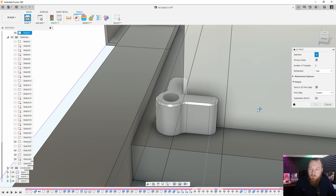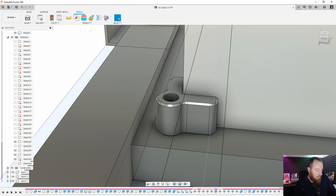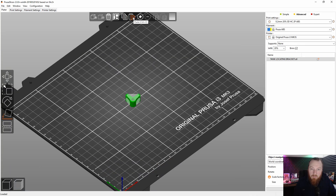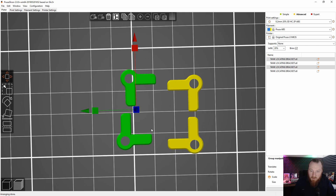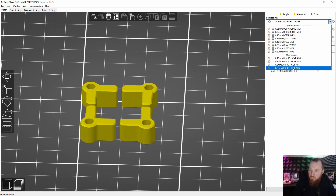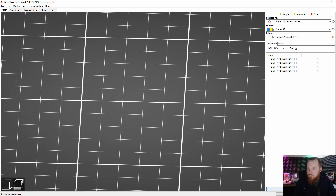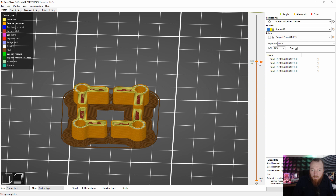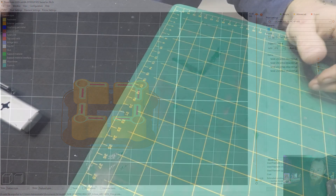Make that, don't send it, high quality. Alright, twenty percent infill, four perimeters, ABS. Yep, that's good. Let's use that one. Okay, slice now. Pretty basic. I've got some really hard square inside corners there but that's fine. I'll chuck it on the G drive and then pick it up on the computer in the workshop.